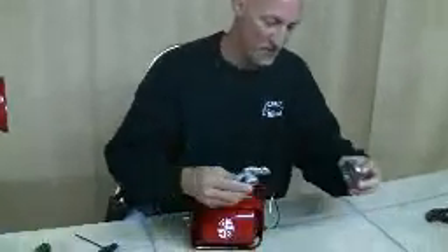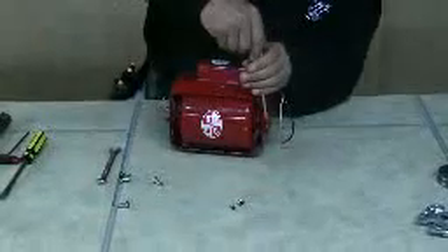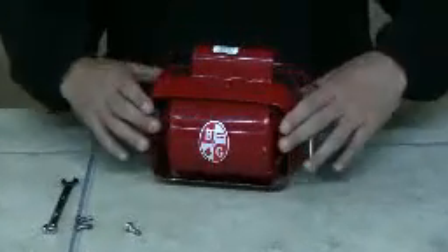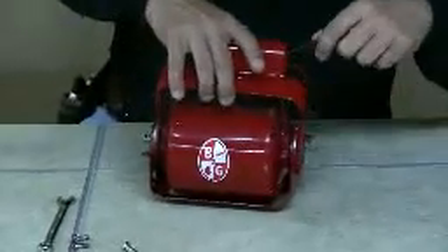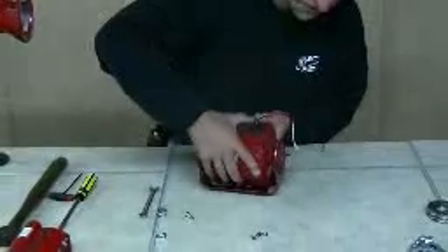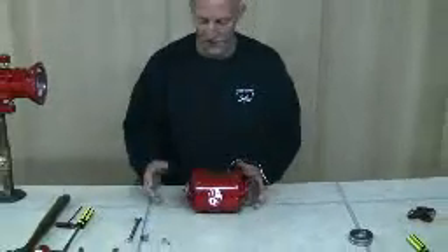Here's the new coupler and a new set of motor mounts — we'll get to that in a minute. To get to the motor mounts on the pump, you'll see the rubber rings are on a little housing on the motor itself, so we have to take this carriage off. That's held on by four Phillips screws. Now that we're taking the last screw out of the motor bracket, lift the top off, and your wire will come through the head of the motor here. Set it aside, lift the motor out of the bottom, and set it aside.